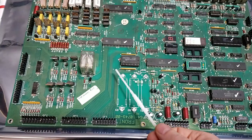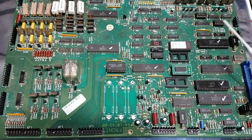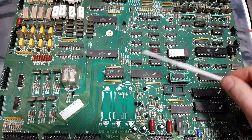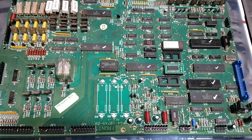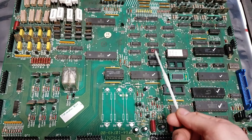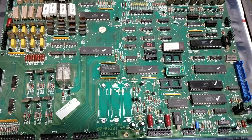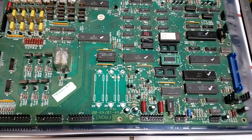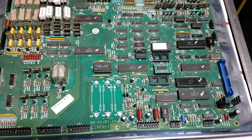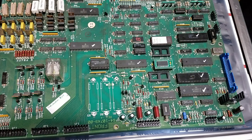I went ahead and replaced U9, but that didn't bring it to life. When I bench-tested it, it would give me nothing on the display — it wouldn't light up at all. That's really weird because even if the system is crashed and can't operate, it should at least give you a diagnostic digit — I think it's a 7 for System 9. At that time, seven years ago, I wasn't comfortable using a logic probe or doing higher-level repair, so I just put it in the closet.